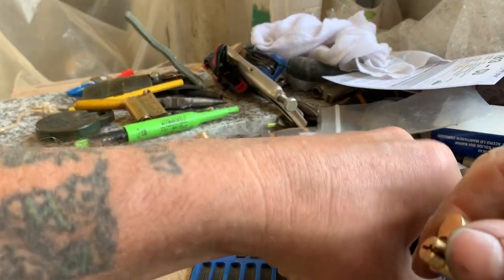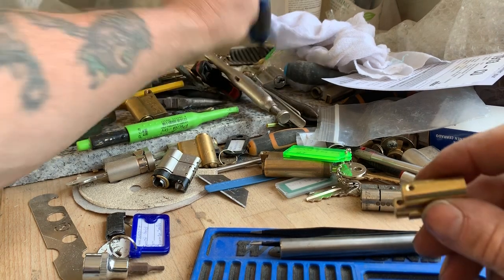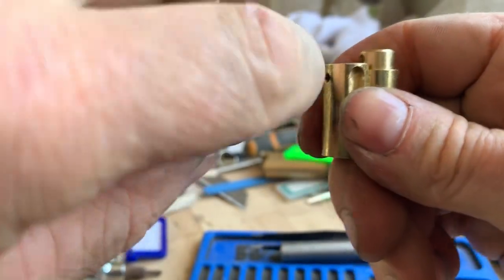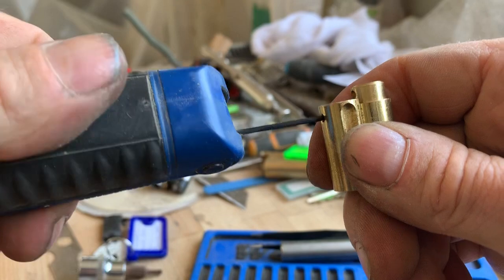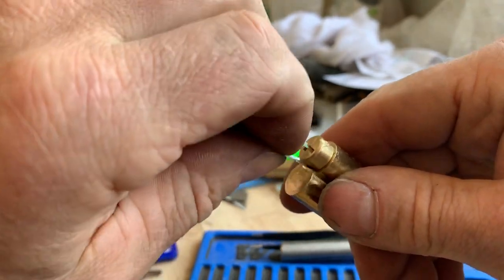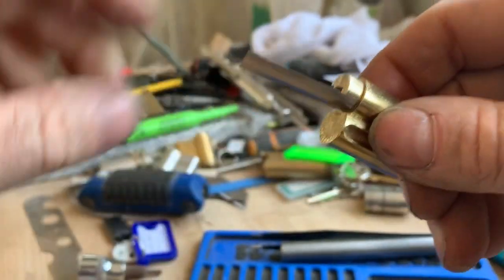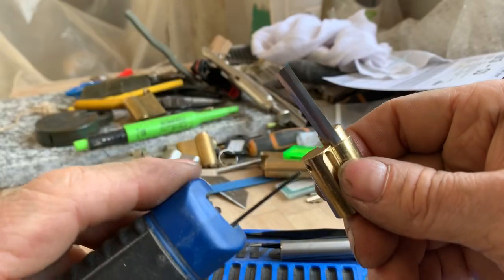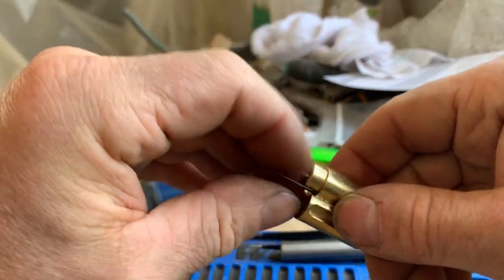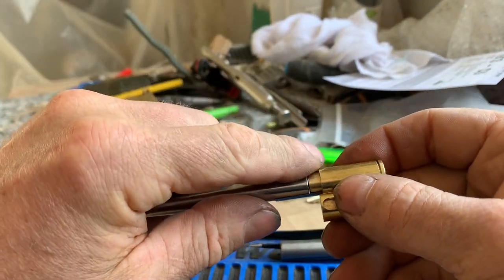Now on return, stick a shim in there — actually no, we won't get the shim in there until we've opened. Taking that Allen key, here's the grub screw right in there. Wind that out a little bit — should be just enough to get the shim in there. We use the 10mm titanium bar from John Egginton.